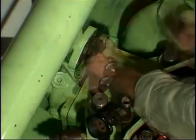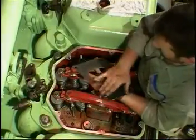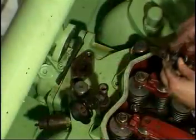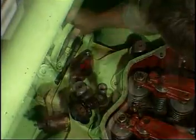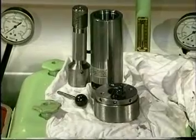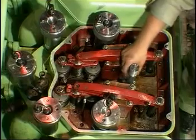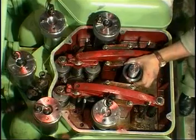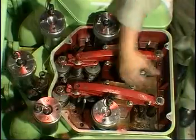Knock a wedge in between the cylinder head and exhaust pipe and insert a new gasket and the screws, but do not tighten the screws as yet. Mount the extension tools, spacers and hydraulic jacks on the cylinder head studs. Make sure that the parts are correctly engaged and ensure that the Tommy bar can be applied through the slots of the spacers.